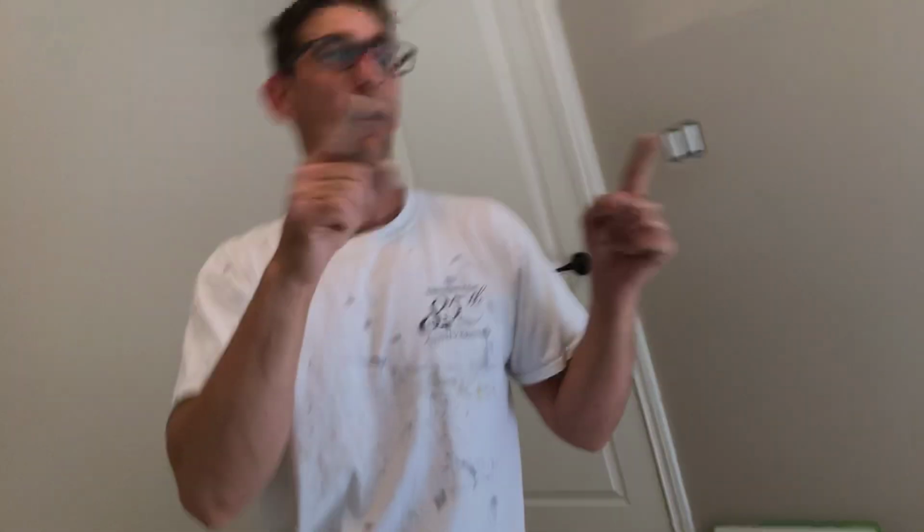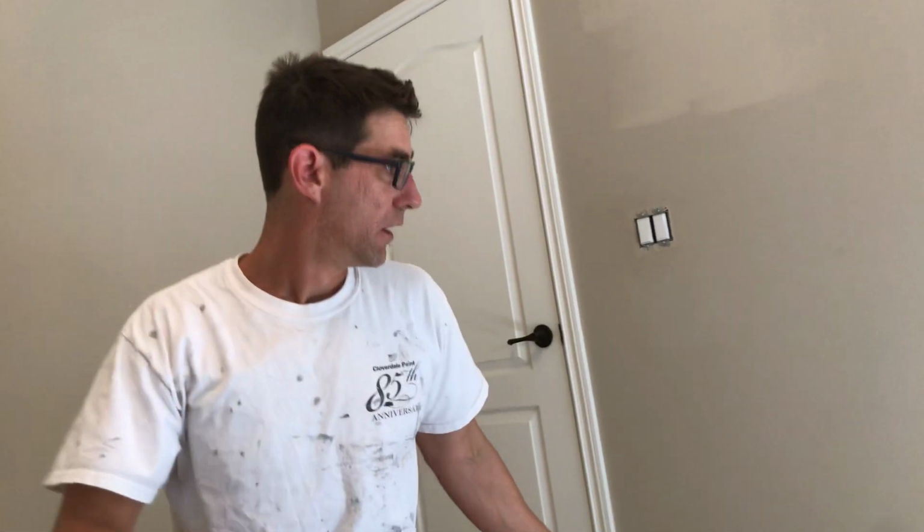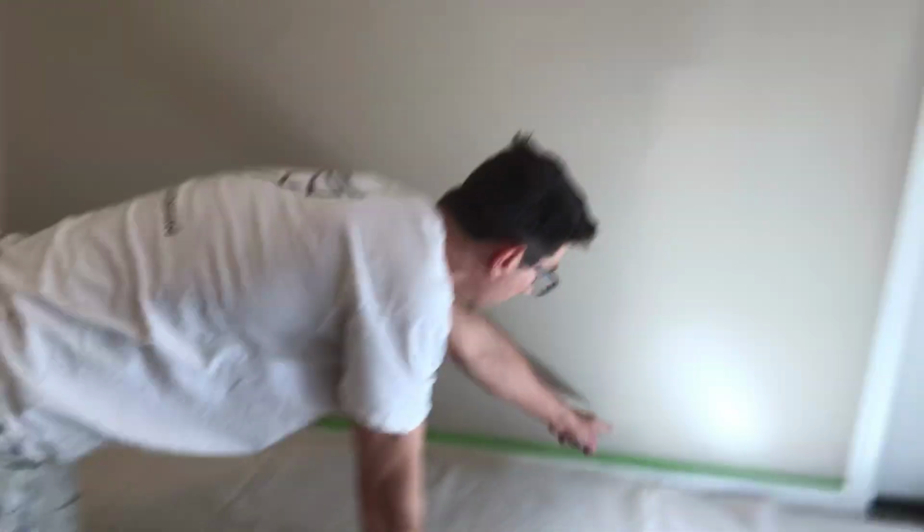So then after 20 minutes or so, come back in the room, and you want to first start cutting around the ceiling. So you want to brush around the ceiling, around the whole perimeter of your ceiling and your corners, right? And then you'll want to work your way down the corner after you cut all your ceilings, right? Work your way down around the corner, work your way down around here, around the base. And then after you have done that, then you can roll it, and then your room will be finished.